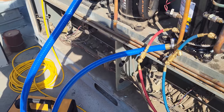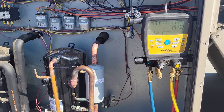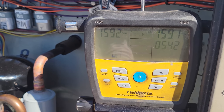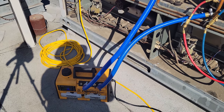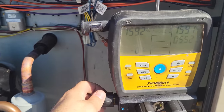We're just getting the vacuum rig set up for evacuation once we hopefully pass the pressure test. I'm very satisfied with this. It's been running 5 minutes and 40 seconds, and we've dropped 0.1 PSI. I'm not concerned about that at all. So we're going to go ahead and get the vacuum rig set up, the micron gauge set up, and get vacuuming